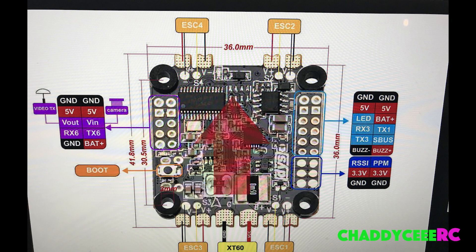Obviously you're going to need a spare UART. I'm using a DYS F4 Pro board and I decided to use UART 6. You can see I'm using ground and 5V, and then RX6 and TX6. I'm not sure whether my board or my GPS has these two flipped, but I did have to flip them once to get the GPS running correctly. So if you plug it in and your data doesn't pop up on your OSD right away, that's probably going to be your issue — easy fix, just unsolder and resolder the connections.